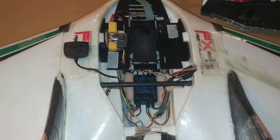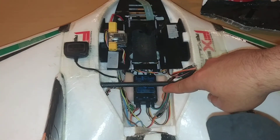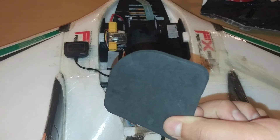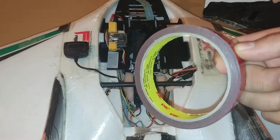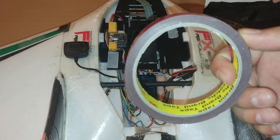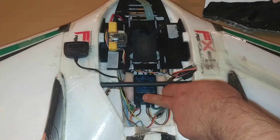How do you mount it? I personally recommend one of these little squishy foam pads from banggood.com — they're like washing machine vibration dampeners. You can cut a piece and put it under the autopilot, which takes care of a lot of vibration. ArcBird also recommends keeping vibration low; keep an eye on the vibration meter on your unit and dampen it out if abnormal. I've used double-sided tape to stick it down. I don't recommend glues like hot glue because they set too hard and transmit more vibration into the unit. You want to create a slight damping barrier between the unit and the plane.